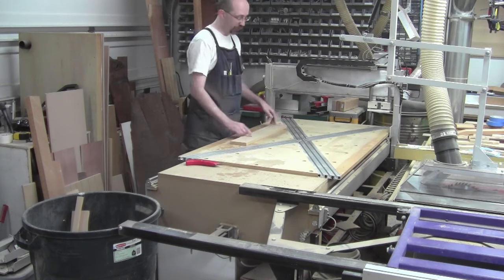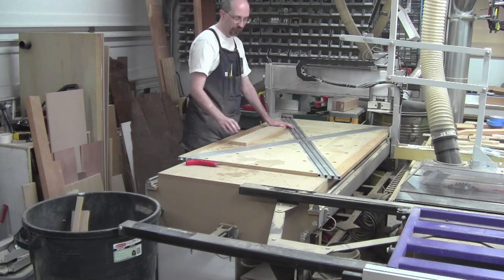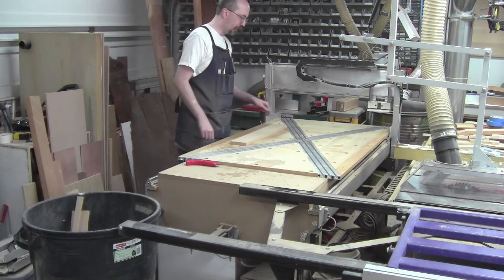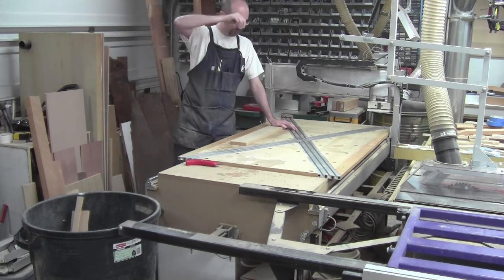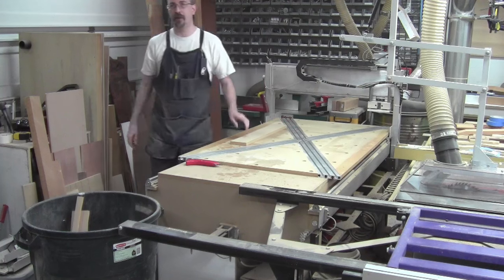Then once those holes are in, we'll do a flattening process just to get it all flat. So once the holes are in, I'm going to mount it with those holes, and then I'll flatten it, and then I'll put the V-carving on top to do the center line and a little bit of a naming thing. So what I'm going to do first is go generate some new G-code for cutting all those holes through, and then I'll get back to you in a second.